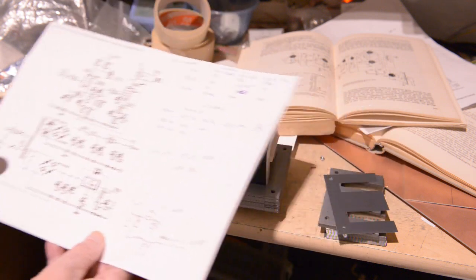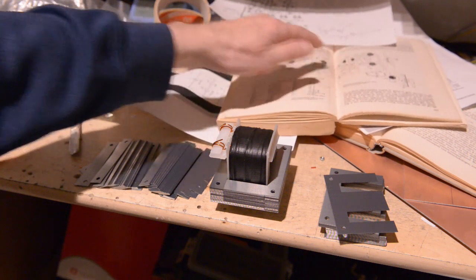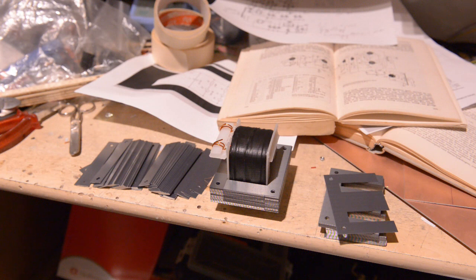This is not what I'm going to use. I have another schematic up here in the book that should be a decent amplifier - it's an AB class, push-pull design. I'm going to look as far as I can see how far I can go with this. I'll probably end up making my own schematic. There are schematics in there I like, and there are parts of those schematics I like. The only thing I have to see is that the amplification of the preamplifier should be enough for a magnetic dynamic element. That's all.